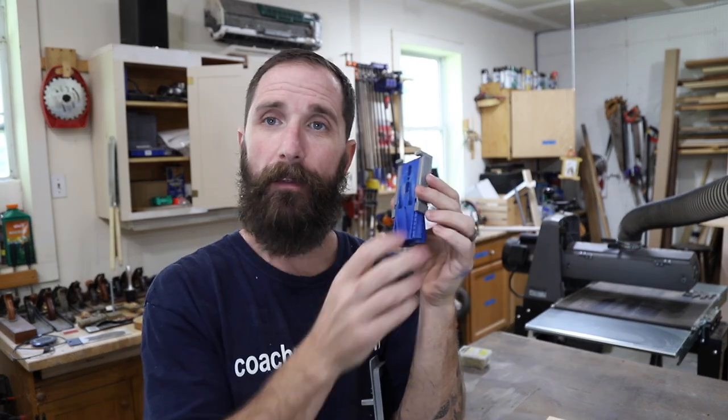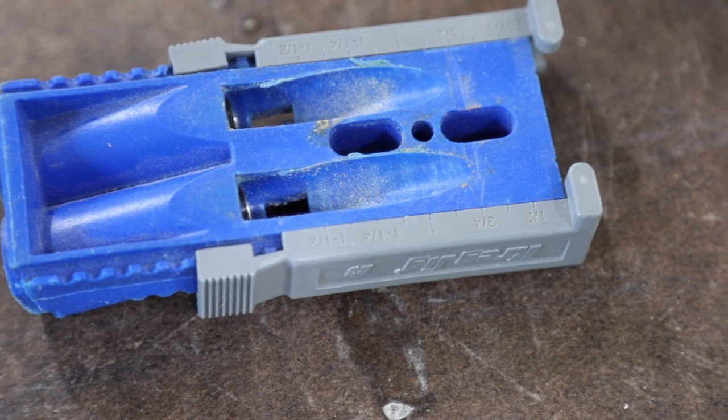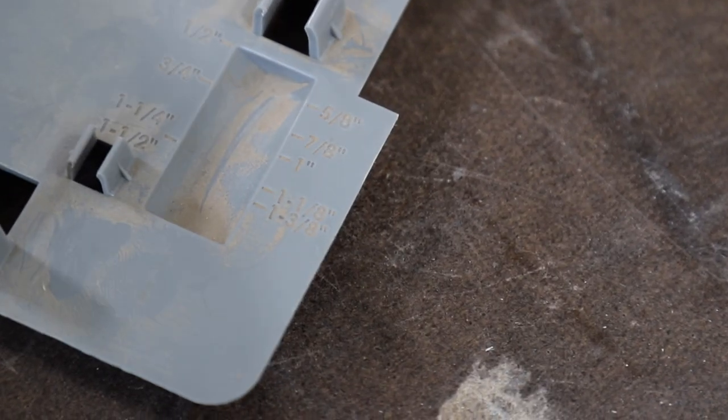With this one here, the guides on the side tell you where to put it based on the thickness of your wood. So if it's 3/4 of an inch, you put it at 3/4 of an inch. To set your bit, they've got this nice nifty little plastic thing that comes in a case, tells you where to put your bit, and it has some marks along the side, which make it super simple. So either way, you get super convenient or a little convenient, you're good.